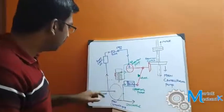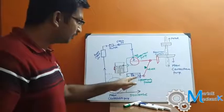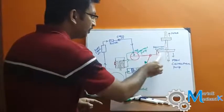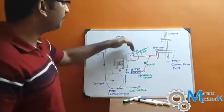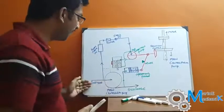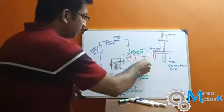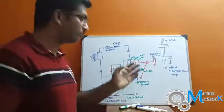To summarize: if there is no water pressure on the discharge side, the spring force engages the friction clutch via the lever, and the air extraction pump rotates, sucking all the air from the casing and discharging it back to the tank. When the centrifugal pump is primed and discharge pressure develops, that water pressure acts on the piston, pushes it against the spring, the lever disengages the drive, and the air extraction pump stops rotating.